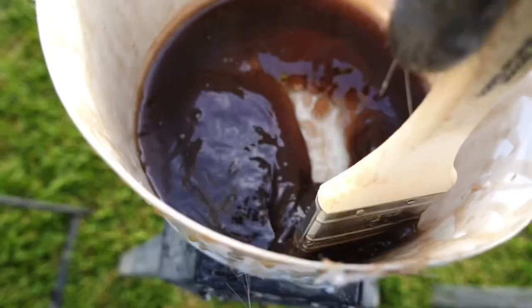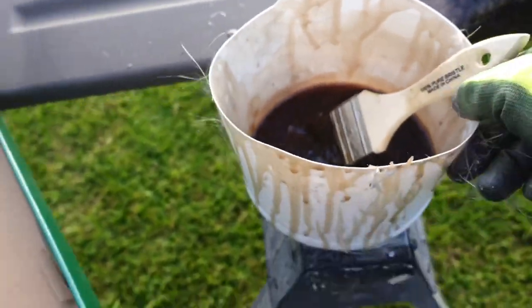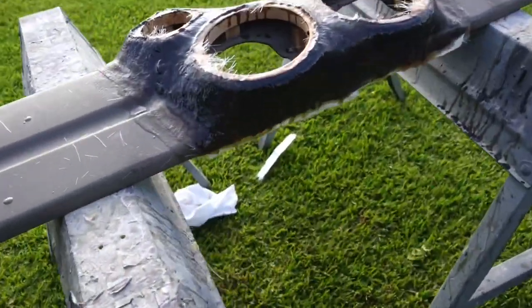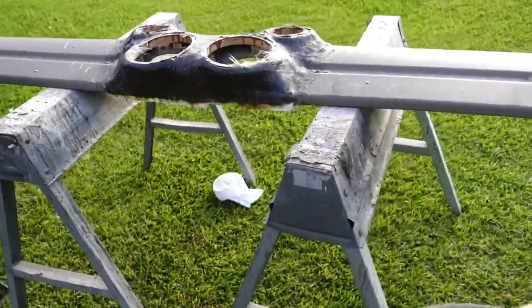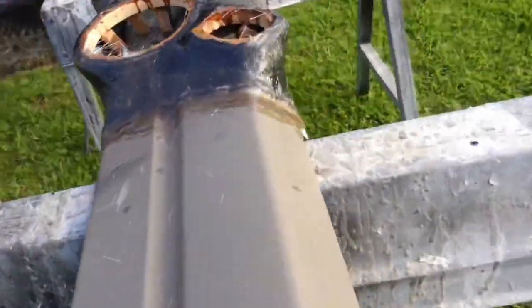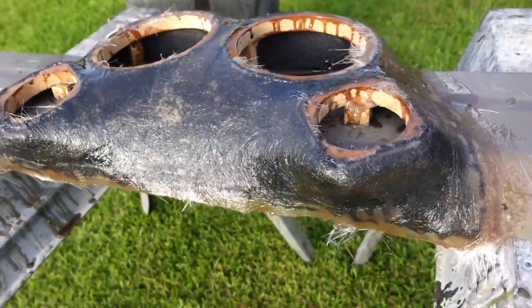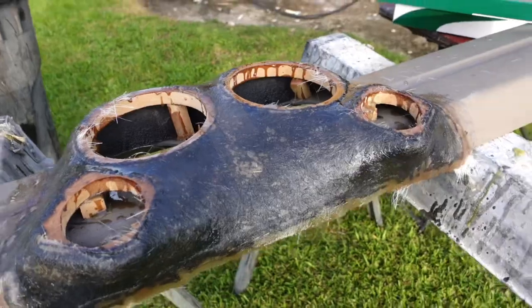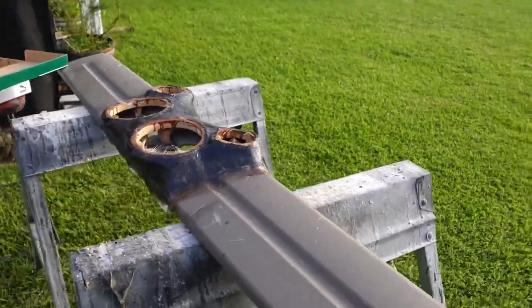So look at this, perfect example. You see, man, it's way hotter than what it was earlier, and this is already gelling up. That means that this bad boy is about to react in the next 5 minutes, but luckily we were able to get fiberglass mat every single place that we needed it. The overhang doesn't matter because it's gonna get ground off anyways. We just need it to really get attached and get strong resin around those rings, and we got it, man. It's really good.